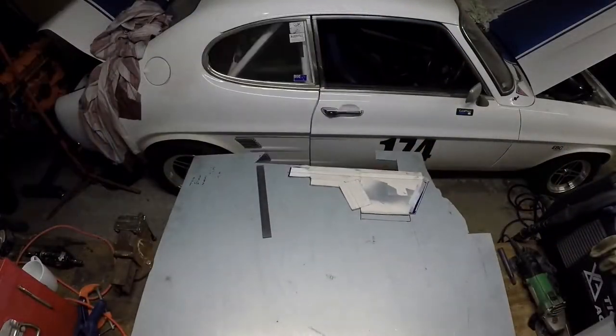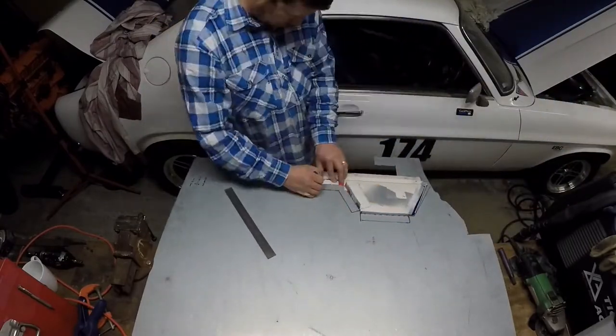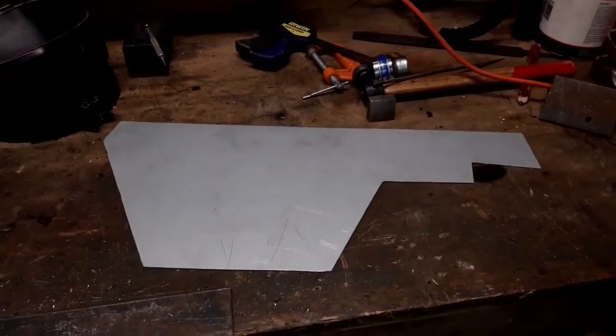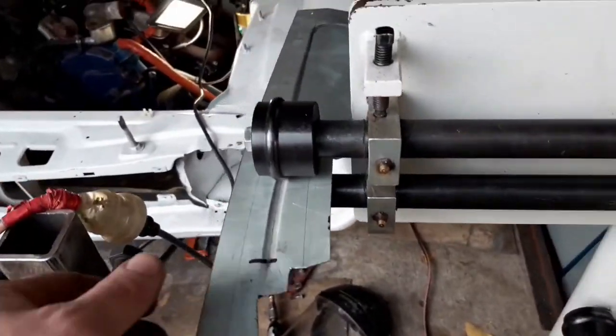With that done I put the side pieces on to basically make it a big air duct. I want to try and funnel air into the radiator, and the front of the car had already been cut up, so I sized them up to work as best as possible — that's sort of how I ended up with the angle I got. Then I stiffened up those sides by putting them through the bead roller, put a bit of a pattern in and a stiffening strip to give it rigidity. All cars are made strong that way by having lots of folds and rolled metal, so just replicating that.